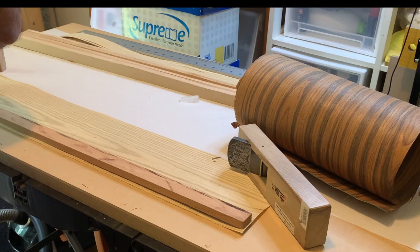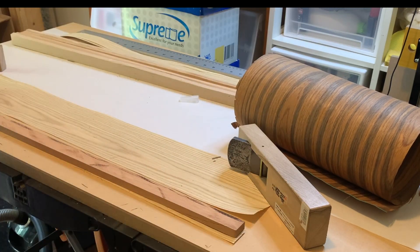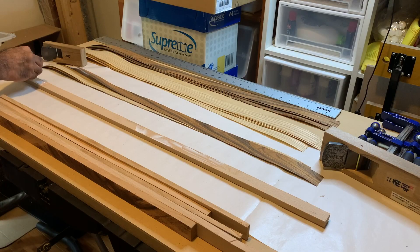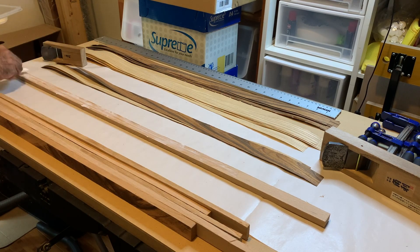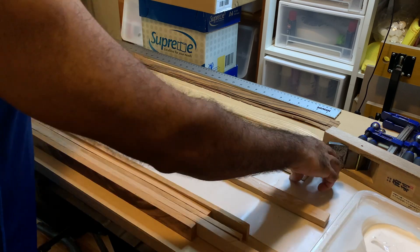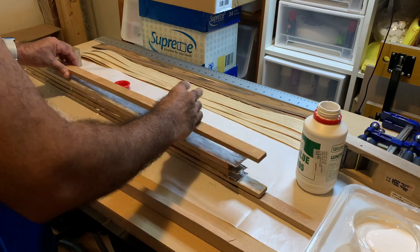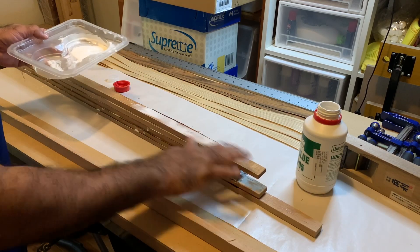In addition to the beech and Nara timber, I used veneers in the neck blank — Santos rosewood and Burmese camphor — so the layering would be rosewood, camphor, rosewood. But between the middle two pieces of beech, I decided to use a single piece of rosewood so that I have a clear center line.